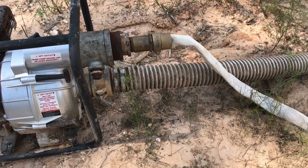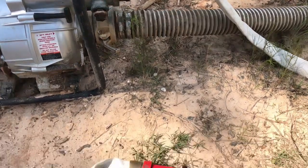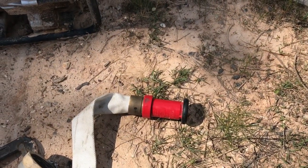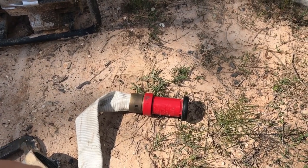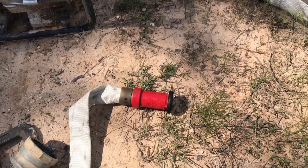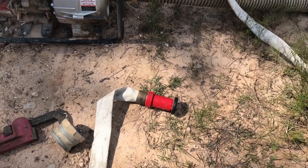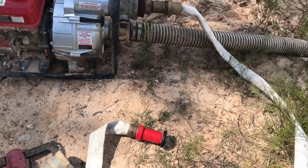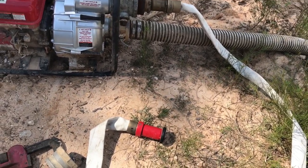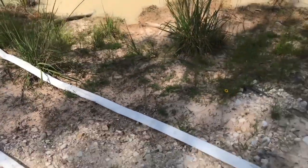I got some of these fire hoses actually recovered out of a construction project — they were going to throw them away. My hope is that I've reduced it down here to a fire nozzle, which I feel is going to be a big broad spray pattern and not a jet. I really kind of want a jet, but we'll just have to see. If not, I'll have to get a different nozzle. But my hope is that by reducing the ID and having the same flow rate, I can jet this water a long distance. I'm wanting to rig this up to see if it'll work when I go to burn brush piles so I can have a way to spray water.